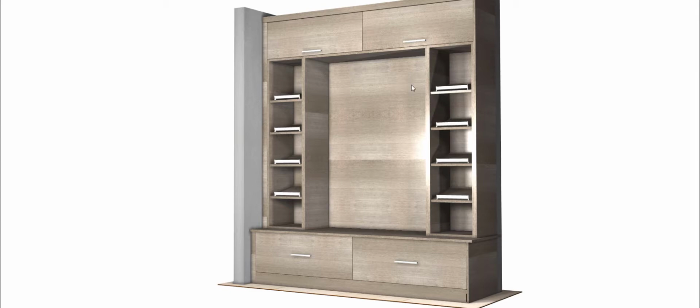Now this one looks probably more complex than you might think. The idea with modern design is to make everything as flush as possible and as clean as possible. So if you notice here, I've got horizontal grain running across all the faces. We're going to use that as a default for all of our cabinets ordered today. We've got flush toe kicks here to make sure that the face of the base molding, which is a separate piece cut and installed right there, matches up nice and flush with the face. It's on the same plane.